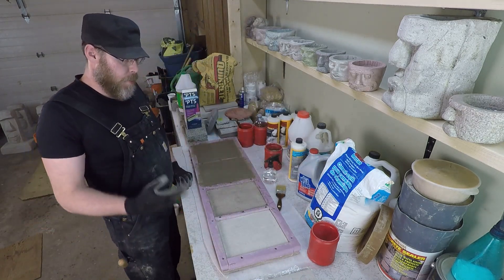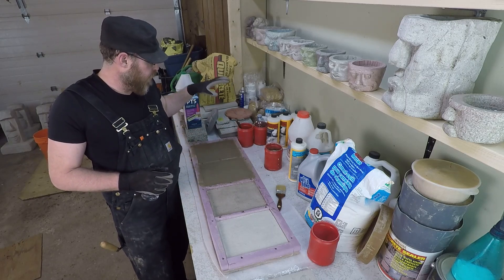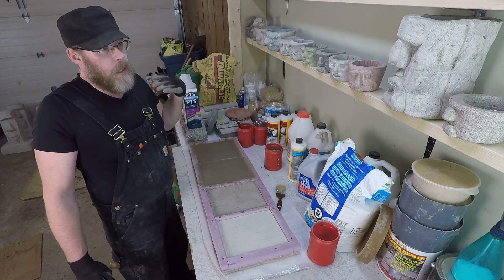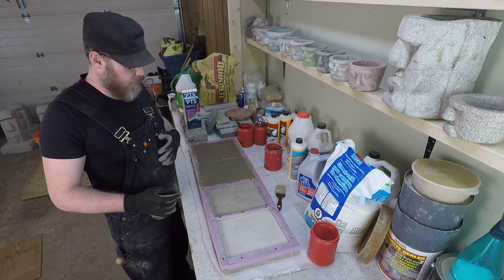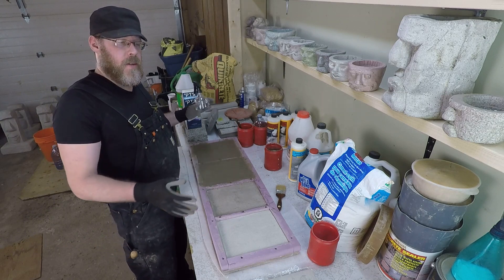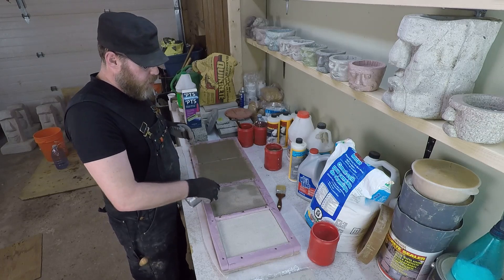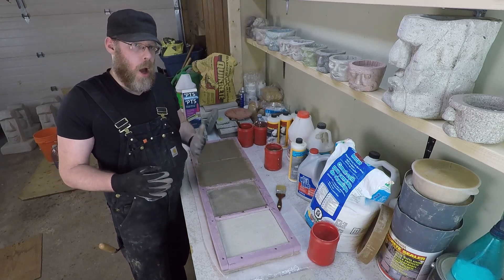So PVA, or a modified PVA product, is what we're using here. The first couple of applications for bonding new concrete to old concrete we're using latex, and that's something I use for water applications — things where I'm worried about water permeability or chemical resistance. PVA is for different applications. Working with concrete is a really deep and technical world, and the applications I would use PVA for would not be ones where it's underwater or anything like that.